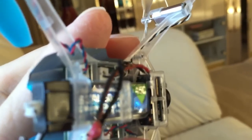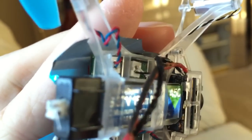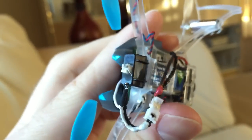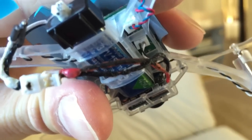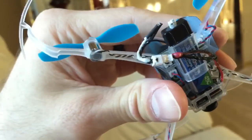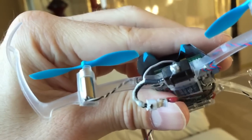Let me try the other camera. Okay, there you can see the black wire where they resoldered it onto the board and it was fine, and then the black wire eventually, from use, from it just dangling down and changing the batteries out and everything, it fused down here together, which obviously burned up these 2 wires and this connection point, as well as that connection point to the battery.